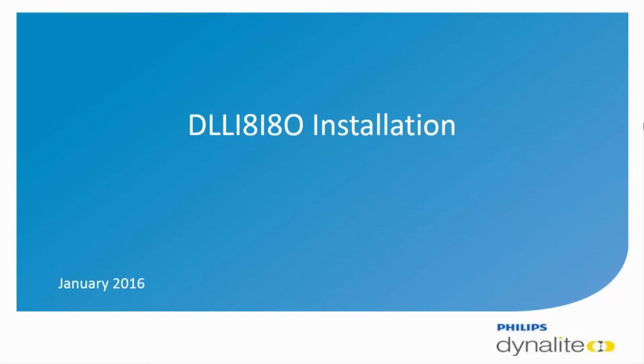This instructional video contains the steps on how to prepare and install the Dynalite low-level interface dry contact device, DLLI8I8O. The DLLI8I8O is a dry contact interface with 8 dry contact inputs and 8 LED indicator outputs that allow third-party interfaces to communicate directly to the Dynet network. This model will supersede the 4-way dry contact interface, DPMI940. In this installation video, a demonstration will include how to connect the device to an 8-input mechanical switch panel